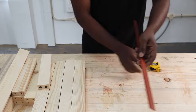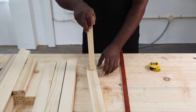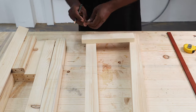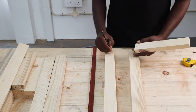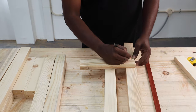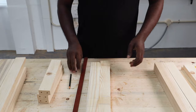For aesthetic reasons, we marked the locations at a distance of one quarter inch from the edge on each leg piece using the drill center. To make sure this one quarter inch measurement was uniform for all pieces, we used a one quarter inch thick piece of padauk we already had to act like a stop block for all the measurements. With three levels of bracing on one side of each leg piece and two drill holes at each level, there will be a total of 12 dowel holes on each leg piece.